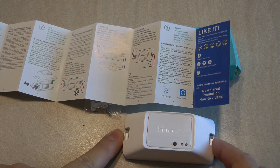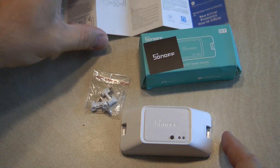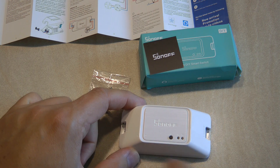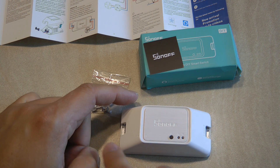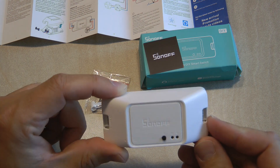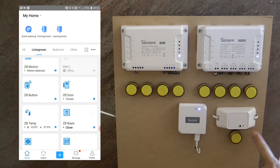Please remember there is no connection for earth, so if you're planning to use it in an application where the device needs to be earthed, you need to route that earth wire separately, either through the device or outside the device. Just make sure you are using this device properly. I have the Sonoff Zigbee Basic installed, and to be honest, even after installation it looks and behaves exactly like a regular Sonoff Basic.